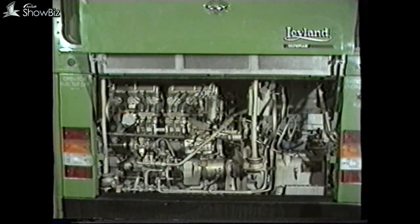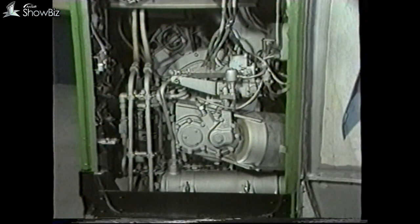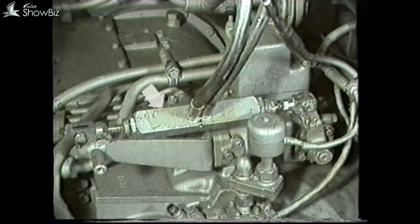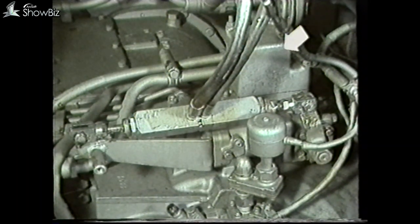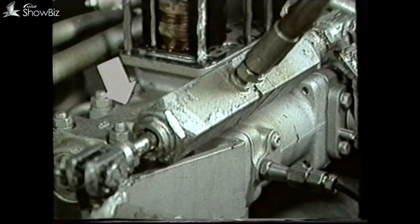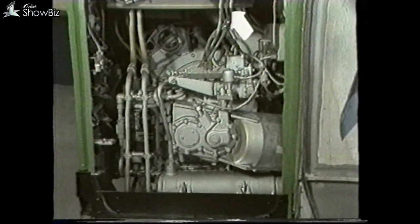The remainder of the controls are mounted at the rear of the vehicle. Here is the electro-hydraulic valve unit containing the gear operating solenoids, hydraulic valves, and restrictors. The transducer is here on the gearbox, monitoring vehicle road speed from the output shaft. This is the retarder operating cylinder, the retarder solenoid, and the modulator valve to control the retarder pressure. And finally the direction valve, which enables both reverse gear and the retarder to use reverse as required. Here are the two solenoids for first and second stage retarder operation.